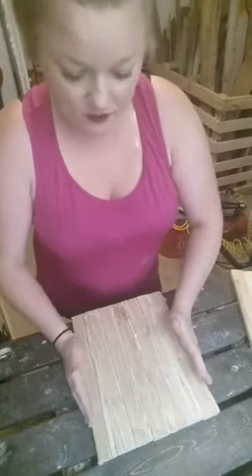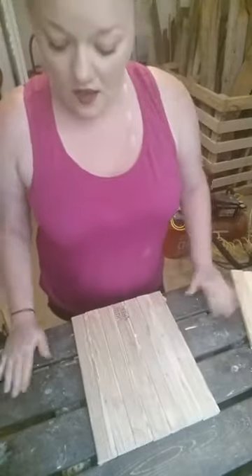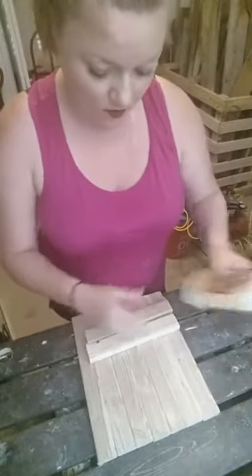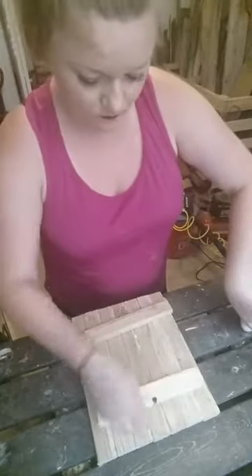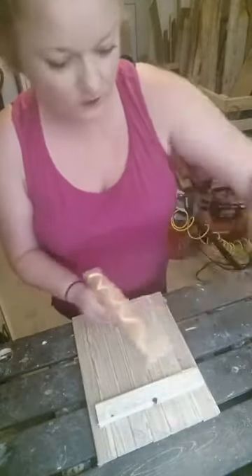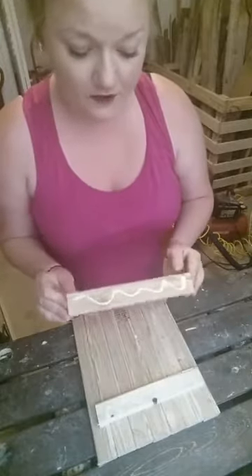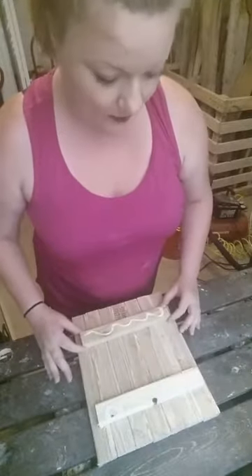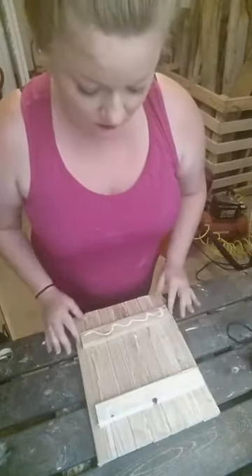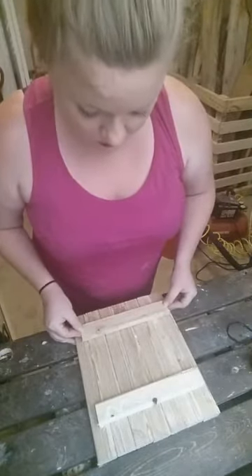I make sure that it's good and tight - it's pretty even to me. If it's not even we can just sand a little bit off at the end. For the more rustic signs I don't sand first. So we're going to get some wood glue - you can get this at Home Depot or Lowe's. I just do a little bit of squiggly lines. I eyeball it rather than measuring from the top to the bottom. I'm going to flip this over so the glue side goes down, placing it about right here, and do the same thing on the top side.